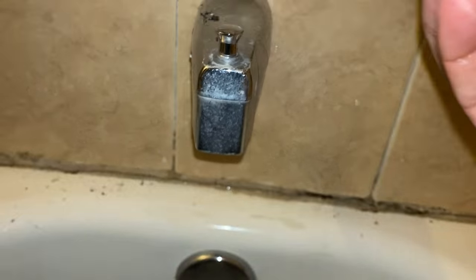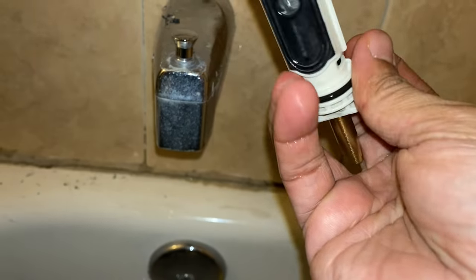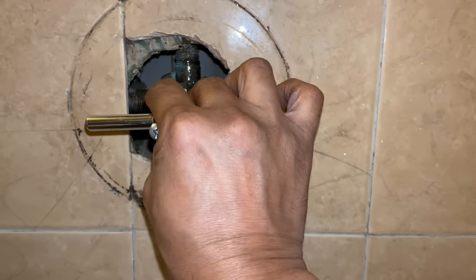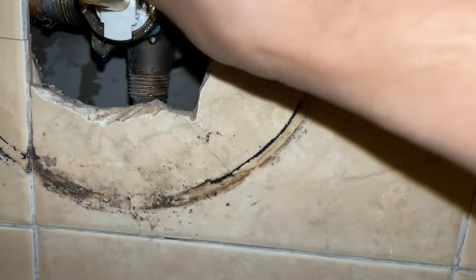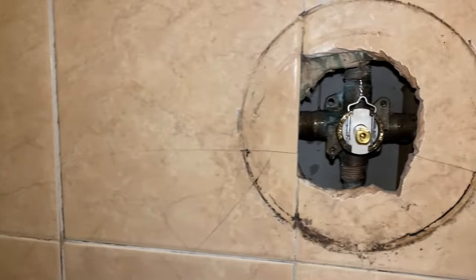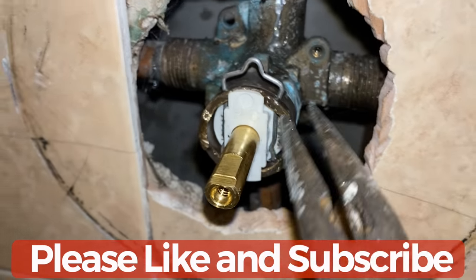Now let's go ahead and put the new cartridge in — make sure it's the right way, with the notch up front. I had to use two hands to put it in. I just took the tool, put it on the front, and pushed it in. Remember the clip that you took out — make sure you put that back in. I put the clip back in and pushed it all the way in using needle nose pliers. That was the end of it. My main focus was to share how I removed my plastic cartridge and installed the new one — hopefully it helps. If you liked the video please give it a thumbs up and subscribe to my channel.